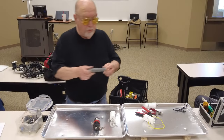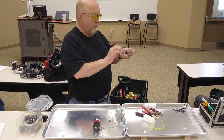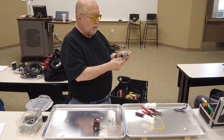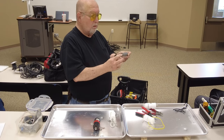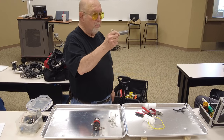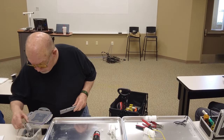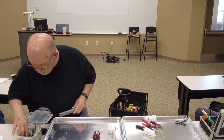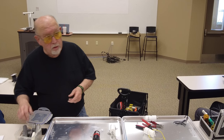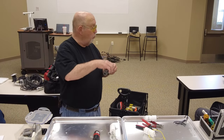And if you want to, you can even make the center insulator. Bring your coax up and loop it through. Put a cable tie over it, take the ends and thread your wire through there. Let's wrap it up. You can put an eye bolt. Well, I got one in here somewhere. You can put an eye bolt in it if you want to. If it were me, I'd just drill another hole through the center and tie the rope on it.